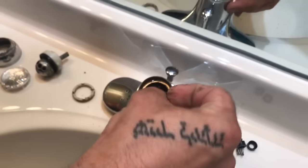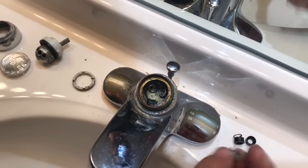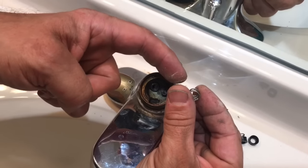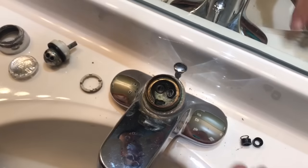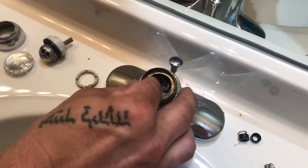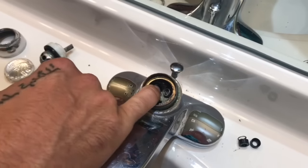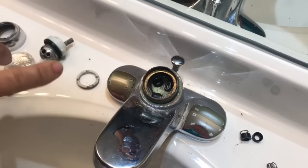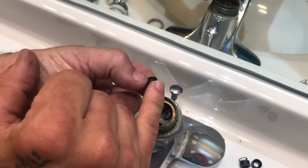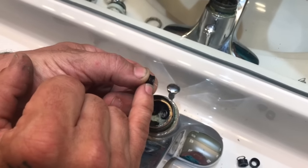All I'm going to do is put my springs back down in there. They have — I'll show you on the old one — a diagonal kind of pyramid shape to them where the top is more narrow than the bottom, and you want to orient it so that the narrow part faces out. Then you just got to work your little caps down in there so they will cover the spring. They'll sit on that narrower part and they might not want to stay — they might feel like they want to fall out — that's okay. If you look on these guys, they have a rubber O-ring on one side and kind of a flare on the other, and you want to make sure that flare goes down.